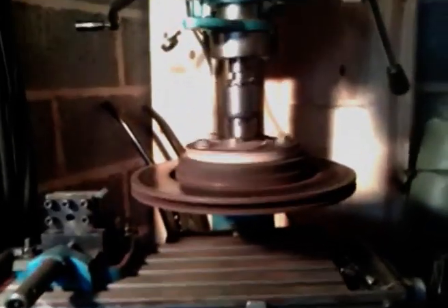With the disc assembly located in the Jacob's chuck — ideally I'd use some sort of collet carrier, but I haven't got one — we turn it on. You can see that the top surface of the disc carrier is moving up and down. For the disc itself, very little movement. When I've measured it, it's been less than a millimetre at the extreme. It's not bad for homebrew engineering.